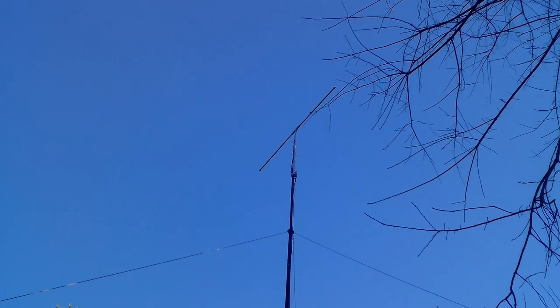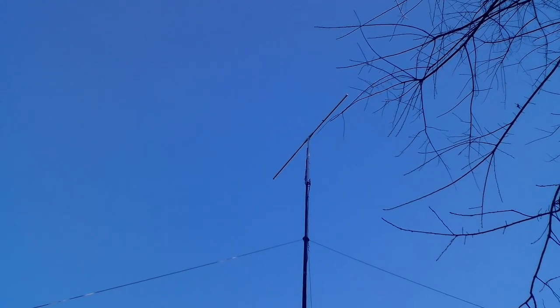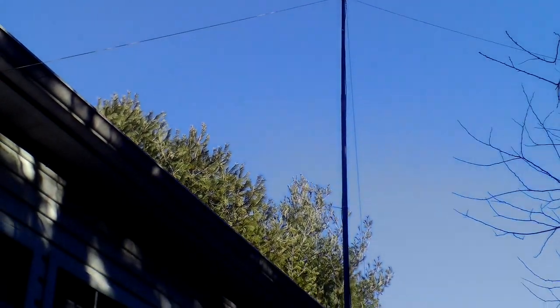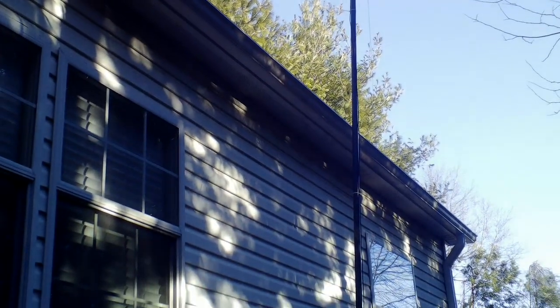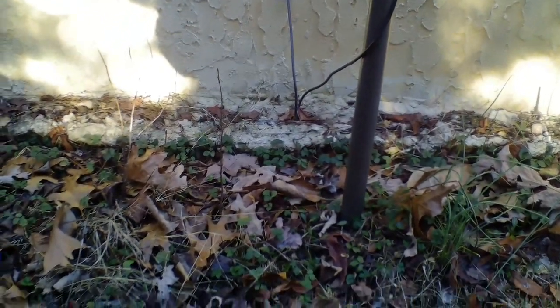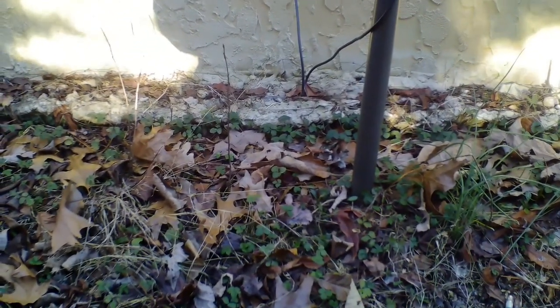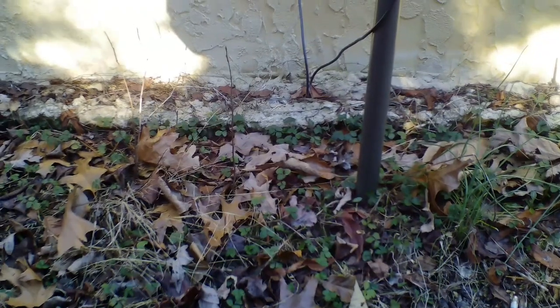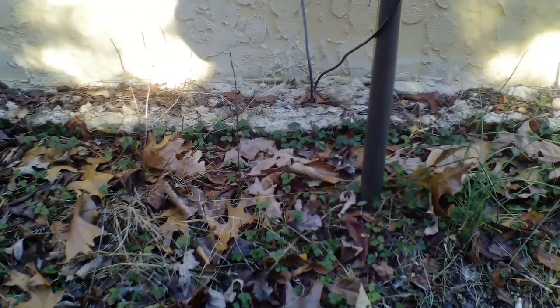The object of this video is the pole itself, which is actual military surplus. We'll scan from the top coming down — you see the guy wires there — and it comes down along the building to the ground. I had an old Radio Shack five-foot antenna pole which I drove into the ground, and this mast pole actually slid over that perfectly, so that's what's mounting it to the ground. You can see the coax cable running there.